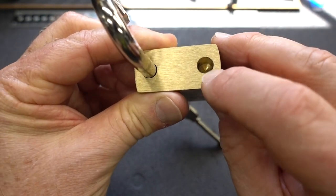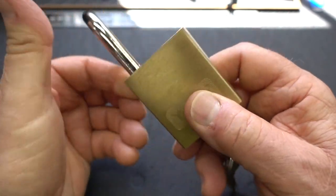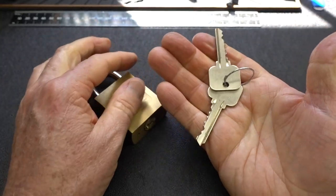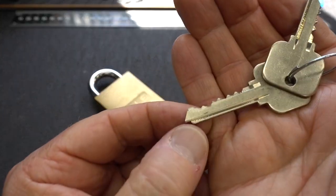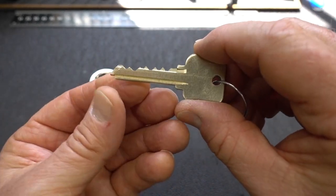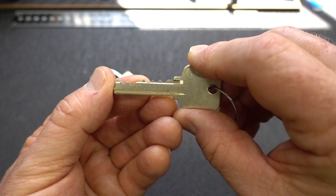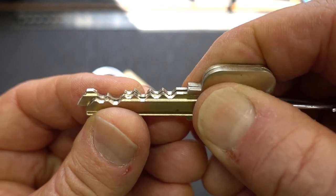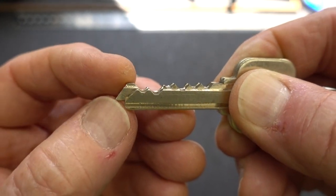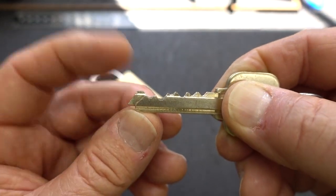The surprise here is that there's no screw. I thought the core wasn't going to be removable after all. But then I glanced at the other key and noticed this one's got a little cut on the end and that one does not. I held them up side by side - it is a removable core. All the cuts are the same except the one with the cut; the back one has an extra position at pin number seven.